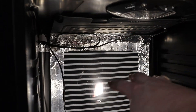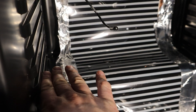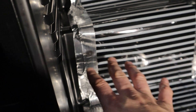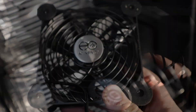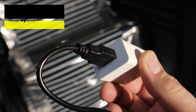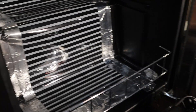Next is going to be installing the fans to circulate air in here. If you don't have fans, your heat's going to rise — you're going to stay warm in the top area and have a lower temperature at the bottom. The plan is to put one fan attached to this little front area at the bottom, which isn't going to be usable for incubation anyway. They are computer server fans I got off Amazon for about $20 for the pair, and they just run off USB power. They do not come with a power supply, so you will have to provide something for that. I've used these in the past — they work well.